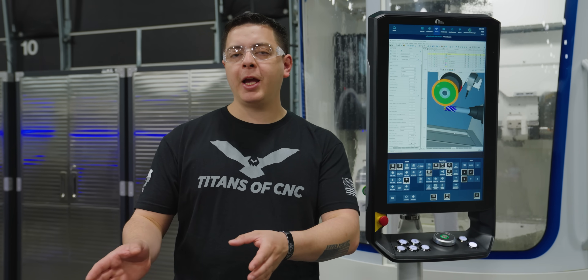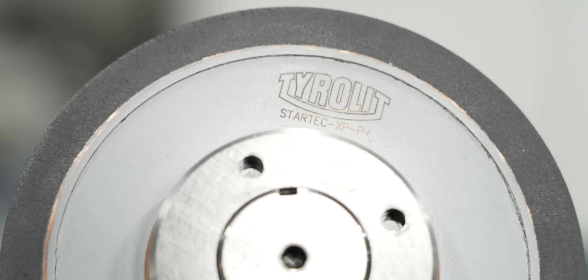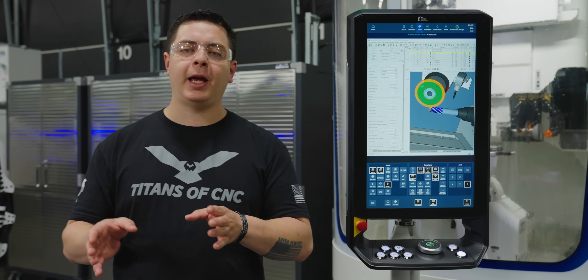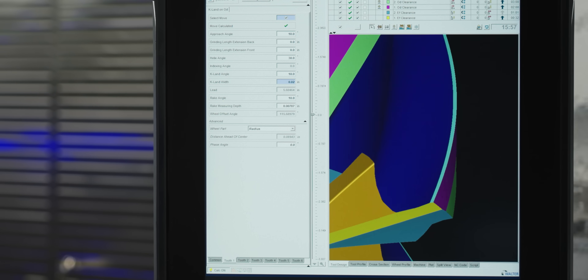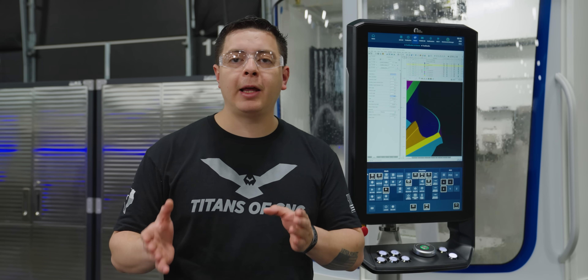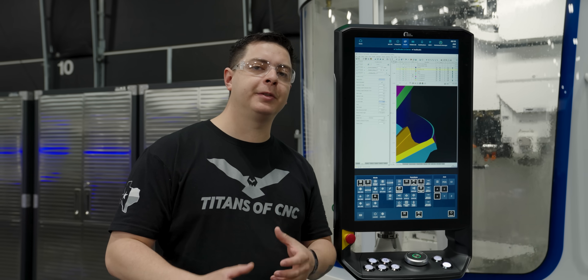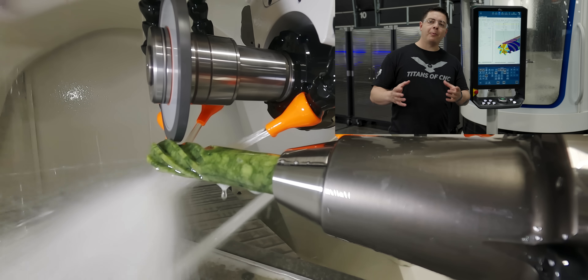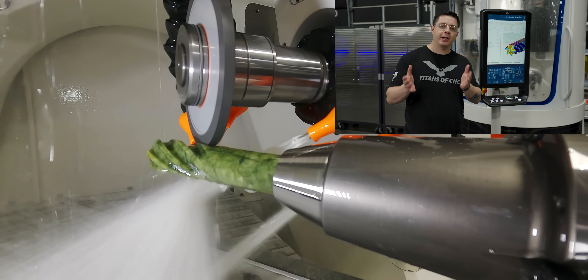On this piece of jade I'm going to create a K-Land on the outside diameter of the cutting edge, using the same Tyrolit StarTech XPP Plus wheel we used to flute it. My flutes are designated by purple, and the K-Land is represented by a light blue surface on the OD. The K-Land is important because jade, being a stone, is prone to cracking once we flute it. By putting a K-Land on the outside diameter I get a polished edge, minimizing chipping and giving this end mill a fighting chance to cut real material.